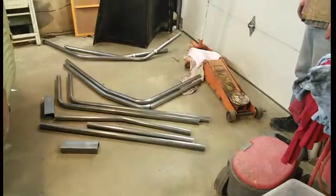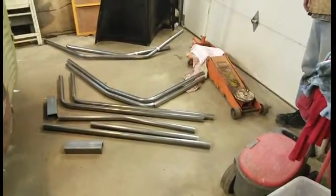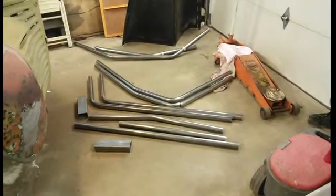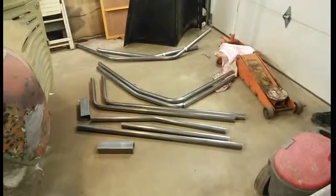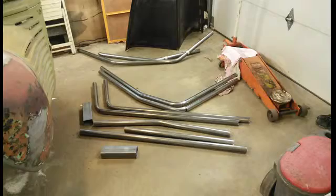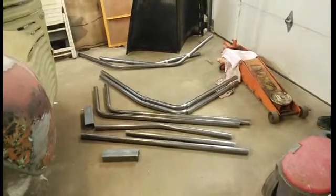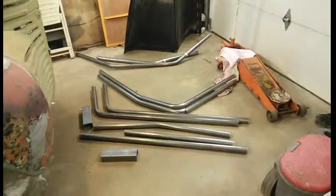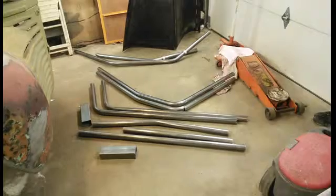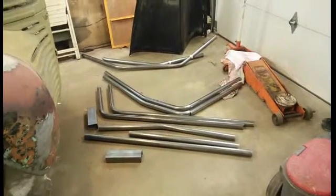Okay, what you're looking at is a roll cage that's supposed to be in an S10, but I sort of figured this would be close and I'd be able to maybe use it, and it doesn't fit, which doesn't really surprise me. The reason I'm looking at putting a roll cage in is because when I jacked up one of the wheels, the front end did not line up and the whole frame twisted. It'll twist back and get back into place, but there's not enough rigidity in the frame. So I'm sticking a roll cage in. It's probably going to be 12 points, and I'm doing it just to stiffen the frame.